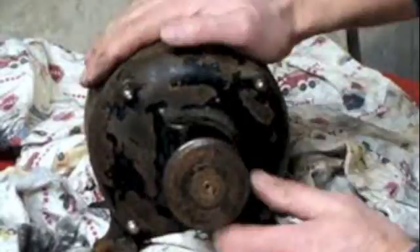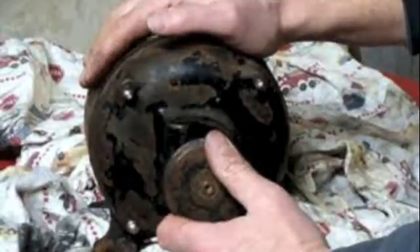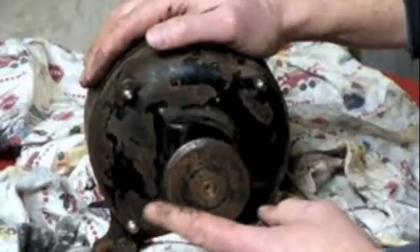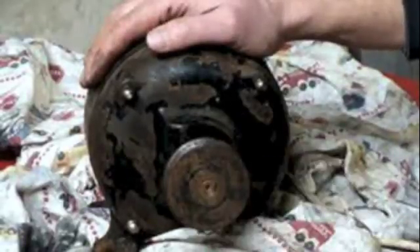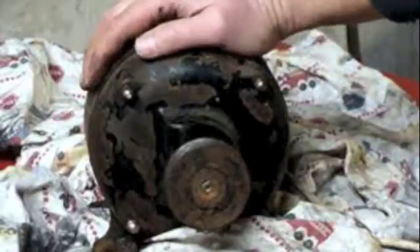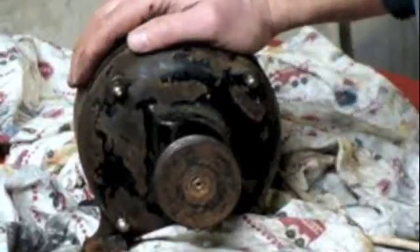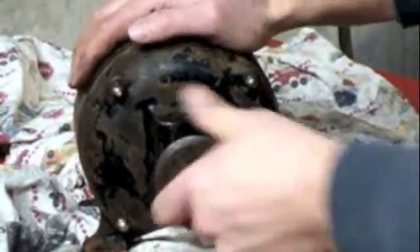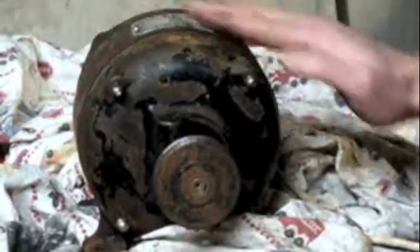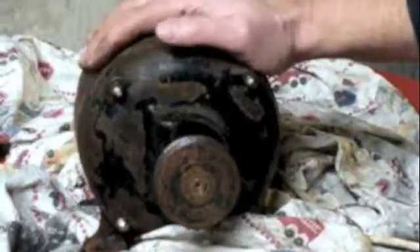That will be the correct rotation for the lathe. The bad news is because this is a split phase induction motor it's got low starting torque, which is not ideal for a lathe because of the chuck. We might be able to get around that maybe by using this cam lock to put it almost in neutral - start the motor and then engage the belt drive. It wasn't designed to work that way, but this is also only a quarter horsepower motor. I'll be curious to see how it fares once we actually start doing some turning on this lathe.